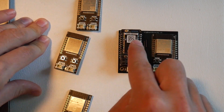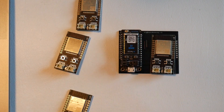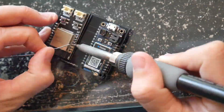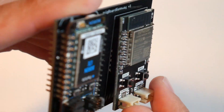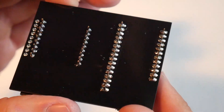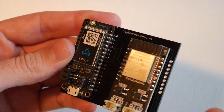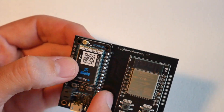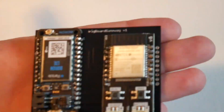The first thing I'm going to do is solder the boron and trig board to the gateway. I just had a couple of spare headers I cut down to mount the trig board to the carrier board, then solder down the boron module — that's all there is to it. You don't need a carrier board; you could just wire over to the trig board — it's only TX, RX, 3.3 volts, and ground. But the carrier board keeps it nice and clean.